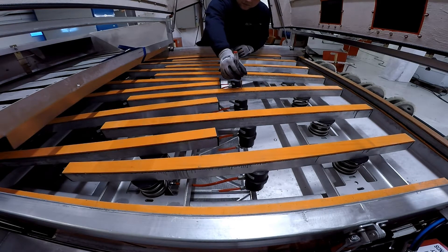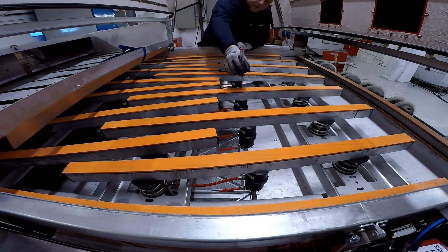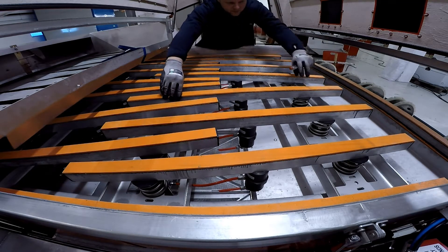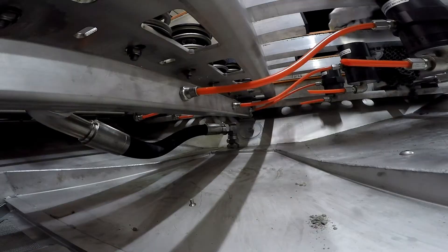Check your vibrators now: turn on to remote and start them up — just the vibrators only. Check from the middle to the sides. Press down and make sure none of them are split or broken. They sometimes split where the motors are, right in the middle. Check that the rubber mounts are all good.